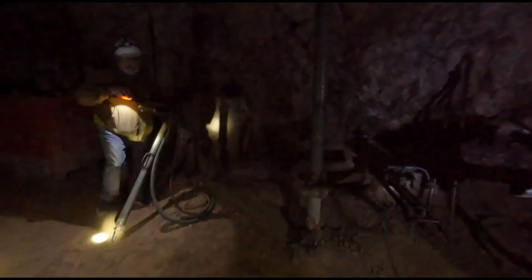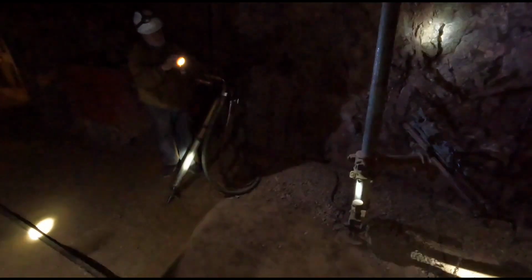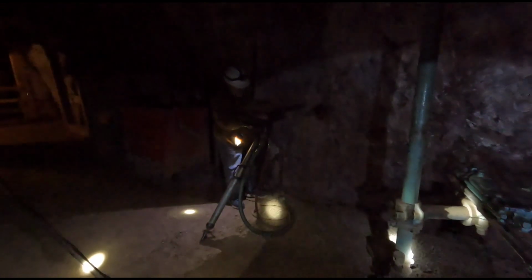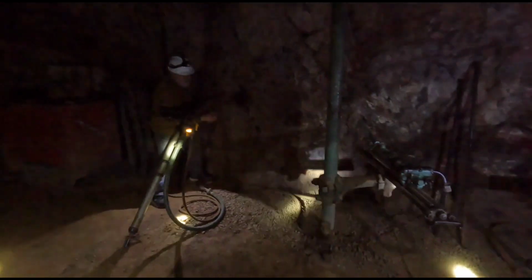It's called a Gardner-Denver jackleg, and that jackleg digs into the ground, and it takes the place of all that column structure and all those jack screws, etc. This thing will dig in the ground, and this drill can take off, and it only weighs like 105 pounds. So one man could manhandle this. That took 3, because that weighs 400 pounds. So one man could pick this up and take it wherever it was needed.